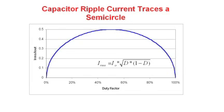Here's the ripple current in a capacitor as a function of the duty factor. This might be the input capacitor in a buck power stage, and the peak-to-peak current in the capacitor is equal to the output current. With zero duty factor — that is, with the high side switch on for a short amount of time drawing current from the input capacitor — the RMS to output current ratio is very low; it's zero. Then it increases abruptly. By 20% duty factor, the ratio of RMS to output current is already at 40%, and it stays above 40% all the way to 80% duty factor. Using this information, you can make a quick approximation of the RMS current in the capacitor by taking 50% of the output current.